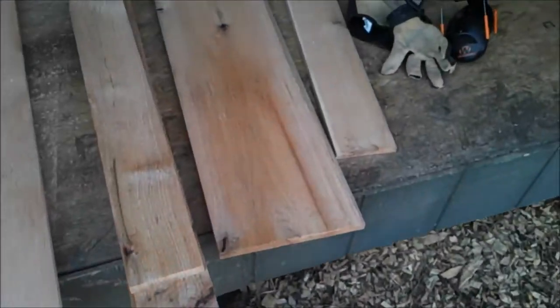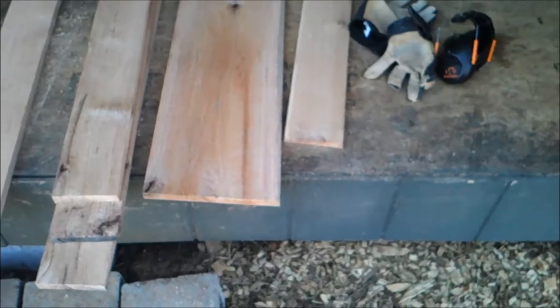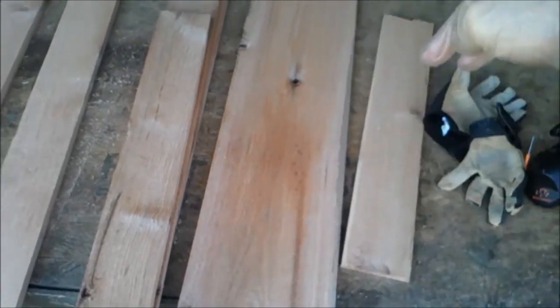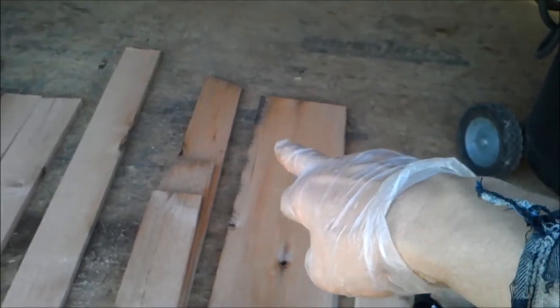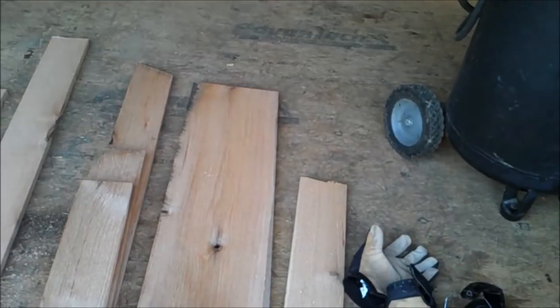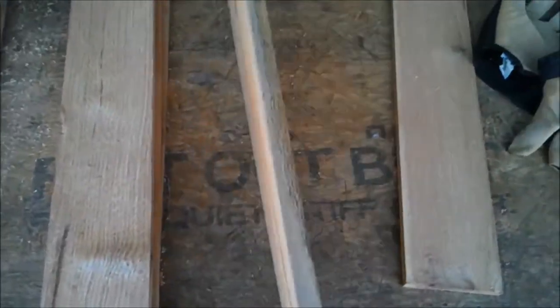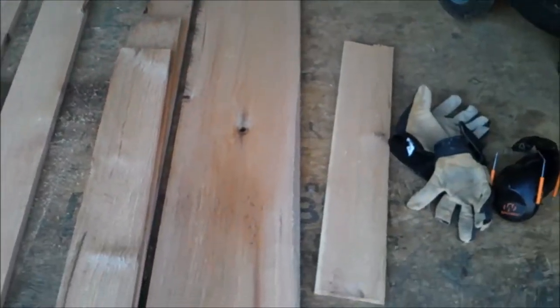I have the two ten-inch by ten-inch pieces. When I started edging these up, I ended up running less than ten inches. That's okay — I'm still going to make it a full ten inches wide. I've got a couple of nice sections. There's still some exposed wood there because of the wood not being thick enough, but I kept planing and planing, and this got down to three-quarters — actually just a hair under three-quarters. So I didn't want to go too much thinner than that, but I'll clean the rest up with the belt sander.